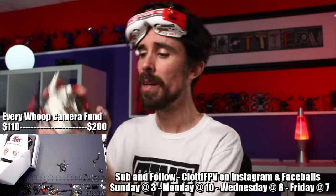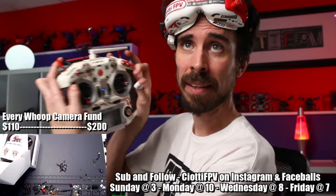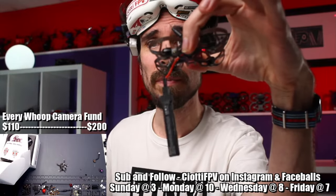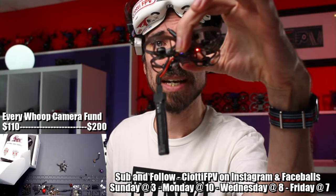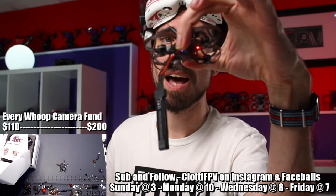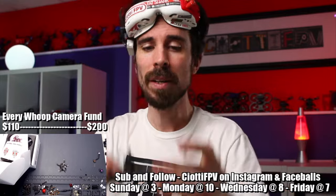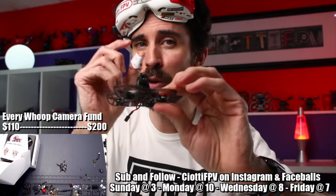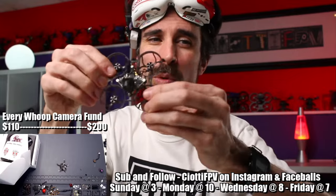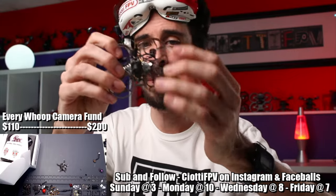We're going to go into turtle mode, and I'm just going to go into the diagonals. And I'm going to do it very gently. So we're going to arm. I'm going to hold the rig in my hand, and I'm just going to feel. Spin that motor up a little bit. Next one, next one, next one. Believe it or not, the left front motor has started to bend the motor shaft. The left front motor, motor number 4, is ever so slightly vibrating harder than the rest. And that's what you're looking for. You're looking to see if one motor vibrates harder than the rest.